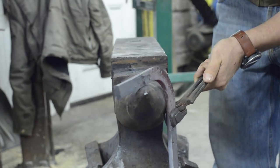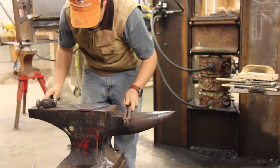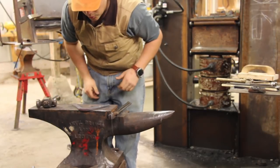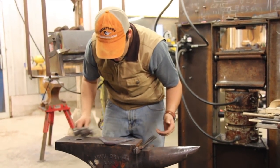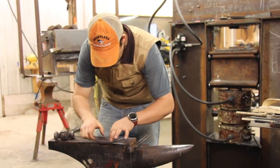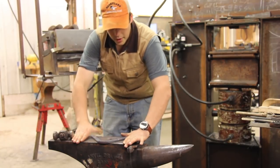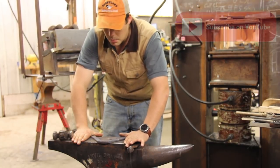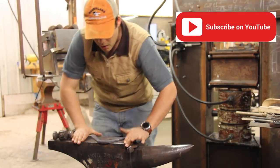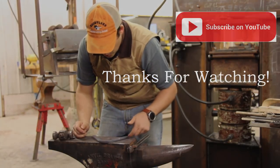I'm just going to lift up and straighten until we get to our training wheel. Anytime that you're looking at shoes, hold them square on the anvil. Use your anvil to your advantage — this anvil is full of T-squares, it's a square piece. So I'm going to line my training wheels up at the far edge of the anvil and I'm going to look: does the angle of those branches come out equally? Is this triangle there and that triangle there? Are they the same shape? All of that tells me a lot about if my toe bend is square or not. You have to get in the habit of holding your shoes square on the anvil every time. Use your training wheels to tell you that you're square on the anvil.